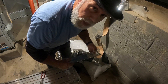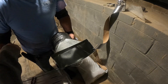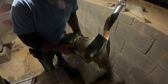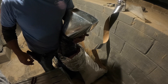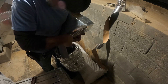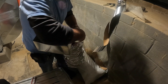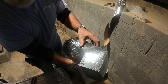My helper's here - I'll get her to hold tape for me. Where have you been all day? Working, okay. You can use mastic for this - this is just quicker and cleaner. Except when the paper gets stuck. The way these boots are made they've got seams - four different seams here - so I always tape them as well.